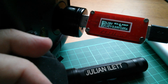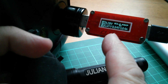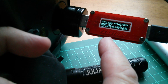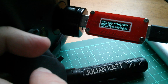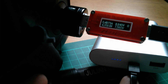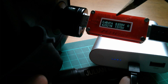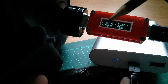It's now detected and settled at 9 volts, showing 0.64 amps on the display. I can switch to another mode to get a watts reading — we're getting 8.94 volts running over USB at about half an amp, so that's 4.3 watts. It seems the YZX Studio power monitor is QC 2.0 compatible and actually recognizes the port, which is good.